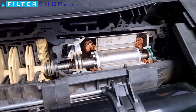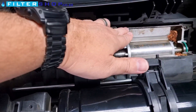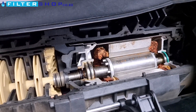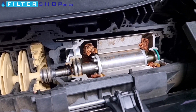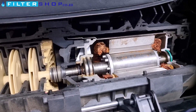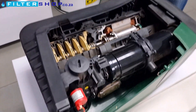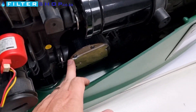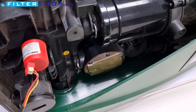We've actually got the whole rotor cut open here. This section here is probably one of the coolest parts of the EasyBox line — it's actually got a jacket which is water-cooled around the pump. So you haven't got a fan cooling the pump system; you've actually got a water channel running through there. And then at the front here where the inverter would be, you've actually got what almost looks like a computer cold plate, linked also into the water supply for cooling.